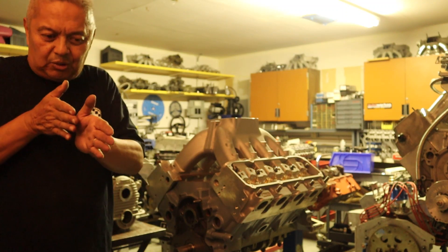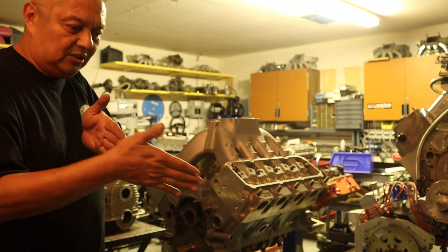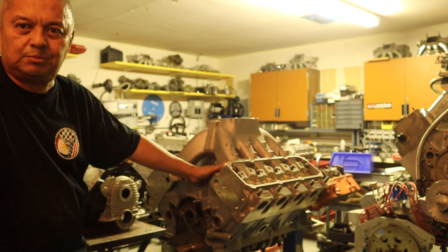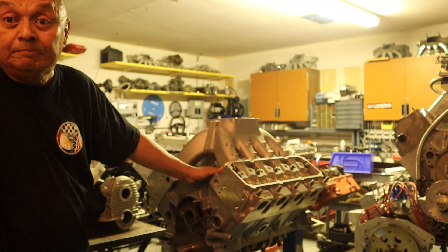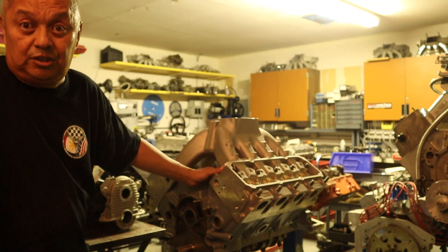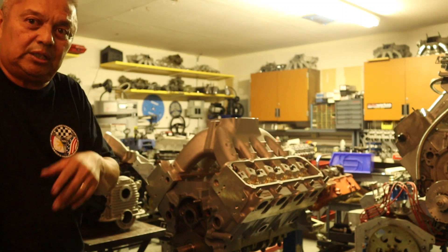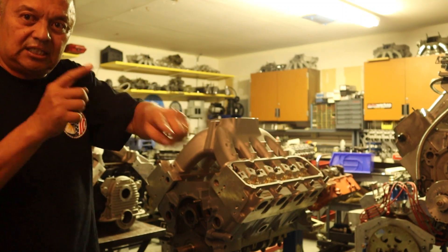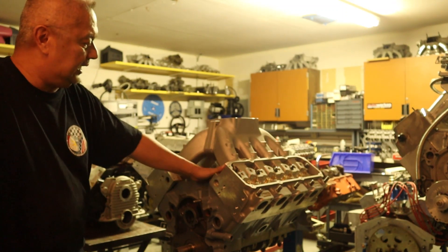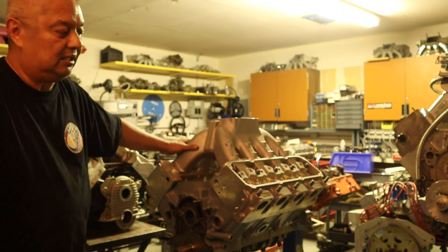The Blue Thunder has a little curve going through the cylinder wall. Anytime you have a little bend it's not going to flow as much. It may have a little swirl-induced mixture motion, especially when it goes to the combustion chamber. But once you start bending it you have two unequal sides, and it has a tendency to swirl clockwise or counterclockwise depending on the approach of the port. This manifold is bolted on the head and flow-tested.